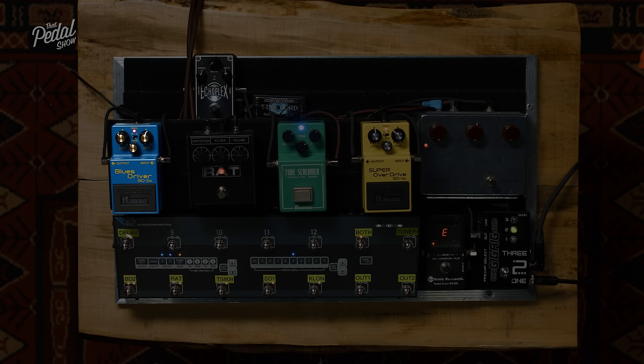Okay, so I'm touching this one. It's got five modes. First of all, you can mix in your dry sound, so we'll leave that off for a second. It's got five modes: two low gain modes and three high gain modes. So we'll go with the low gain modes, and we're going to start, Dan, with symmetric silicon soft clipping. And then we are going to LED soft clipping.